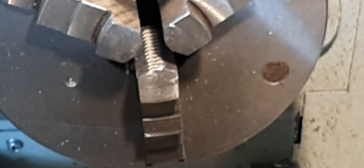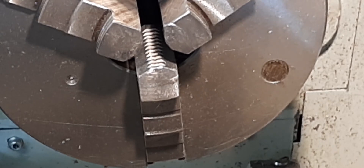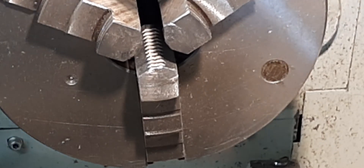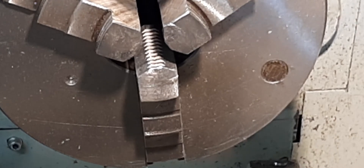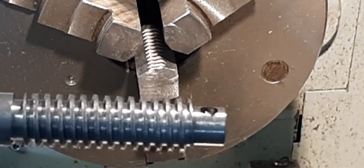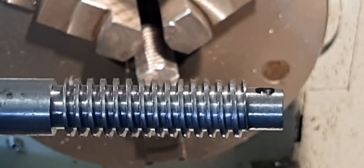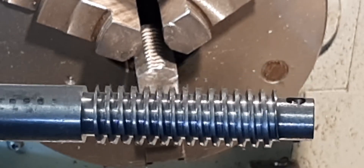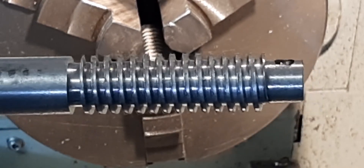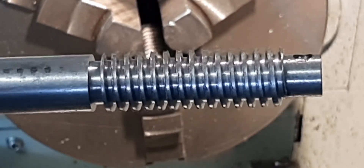And that's pretty much it. I just need to dress the top of the thread as well, just to bring it into size. I can use full form threading inserts, but I choose not to because I like to run a little bit deeper for this application — so it actually is overcut, meaning we've got a bit more threading engagement. So it's not too bad — that's your three-quarter, six TPI thread cutting.